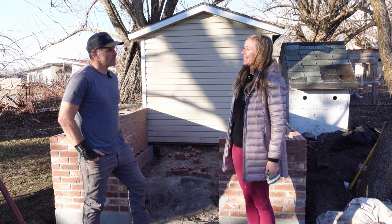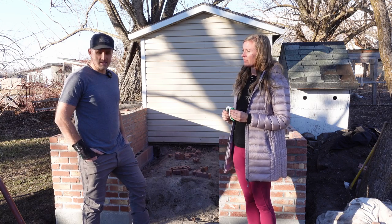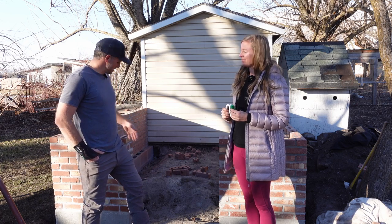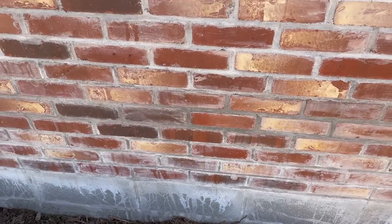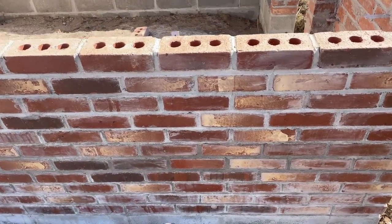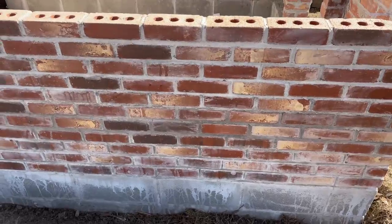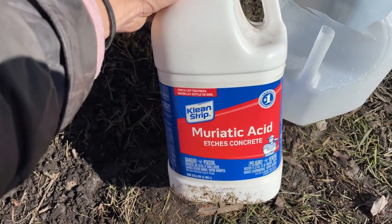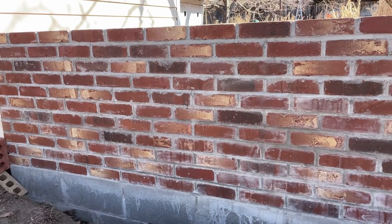This is one project that's been going so smoothly. It's still early February, so we have a couple of weeks to get it finished out. We found out the glass is going to be pretty smooth — no lead time on the glass. So once we get it framed, the glass will go in, we'll put a door on, and we'll be done. As you can see, it's pretty messy, but I wasn't too worried because I knew I could clean it off at the end. You just want to make sure all your mortar and grout lines are cured and dried before you move on to this step — otherwise you're just going to spread more mess. I tried lemon juice and that didn't work at all, so I'm going for the hard stuff. This muriatic acid is pretty hardcore, so make sure you have gloves and safety glasses. If you let it sit too long it'll start to etch, so just don't leave it too long.